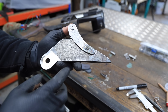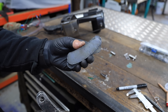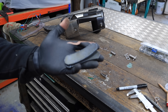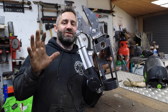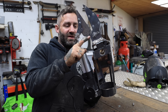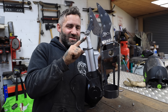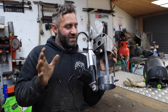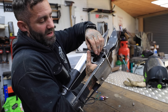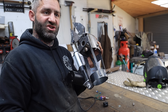I managed to get it all together but it was tearing this part — it's only 3mm — so I've cut some more slabs in 6mm which will work better. I've had to weld it in with a support block and I've welded a 6mm plate on the front because the 3mm was bowing. I also had to TIG weld the back on because it ripped off. Now I need to make an enclosure for the button while still being able to stick my thumb out to access it without any bars getting in the way.